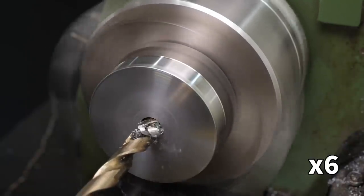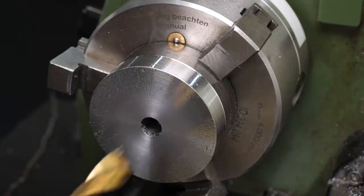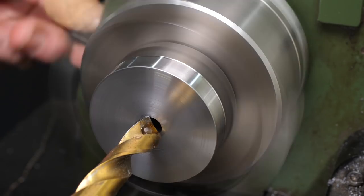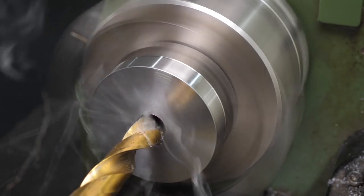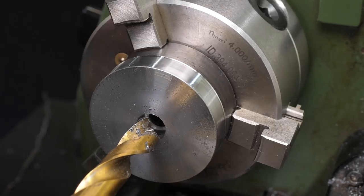It's really easy to wear out the drill if it gets too warm, and I don't yet have the skills to re-grind a twist drill this small. The next drill was 10mm in diameter, and was quite a lot more difficult. The drill is removing material with a much smaller proportion of its cutting edges as it's only cutting near the edge, but this also means it needs more torque, and the spindle was slowing down considerably.